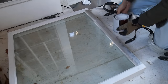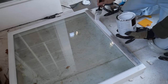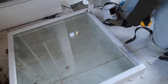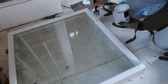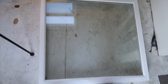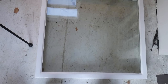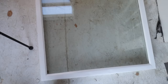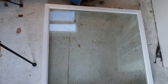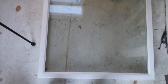The caulking said ready to paint in 30 minutes, so here we go. Aluminum might take a couple coats on its own. That first coat is on, and as I suspected, the aluminum looks a lot less flawed with that paint on. You can still see a really minor dent or two, but I'm happy with it — especially because the window will probably last an extra 10 years or so. We'll see.